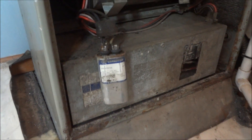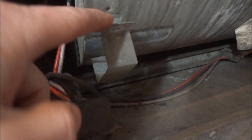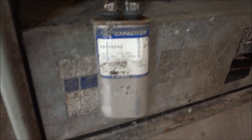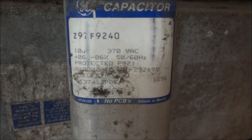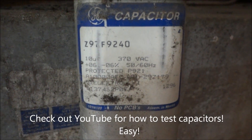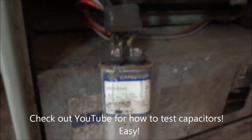Here's where we're currently at. We have our capacitor still attached, but taking off the side — just one bolt there. Here's our capacitor. You can still read the limits: 10 microfarads, 370 volts, plus or minus 6 percent. We're going to test that right now.